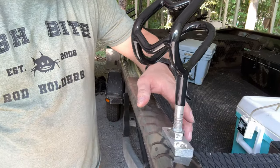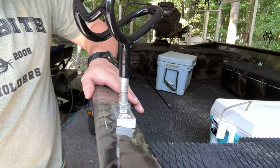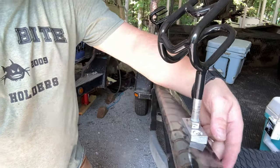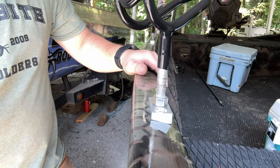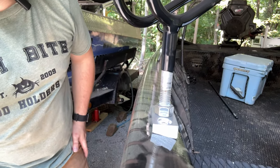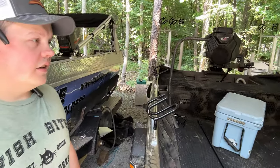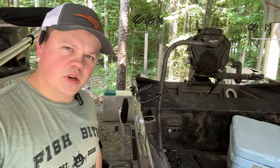We had some gunnels that are not only arched a little bit on top, they're kind of rounded on top, but they also have a little bit of a leaned in angle. So we just took our standard mount kits. They got bottom plates with the stainless hardware and everything like that, and we just had to put an angle there to match that. And if you look on down the line, you can see where it lines up pretty well now. And we want our rod holders angles to match straight up and down as possible.